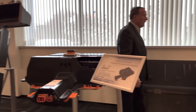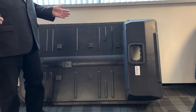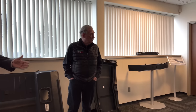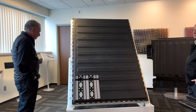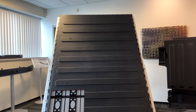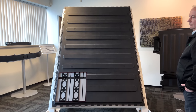You can see the size of that battery box, then it went to the Volt, and now look at these. This is one of the Ford battery box covers. Most every battery box we see right now is about a meter and a half by two meters. We're making 30 covers for different manufacturers and working on some different trays. So we went ahead and built the tooling right into this battery box — this is our property. We made a production mold: a P20 production mold, chrome plated, has ejection and vacuum. It's a meter and a half by two meters.